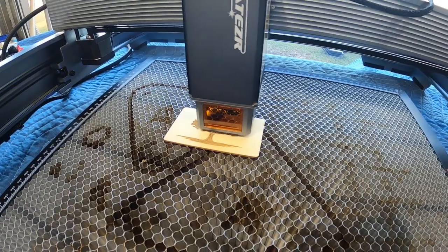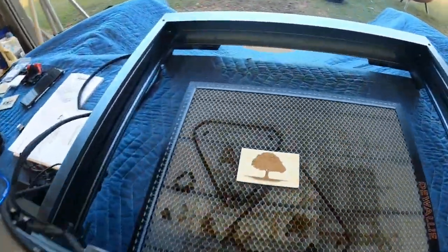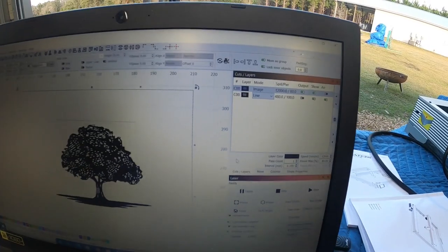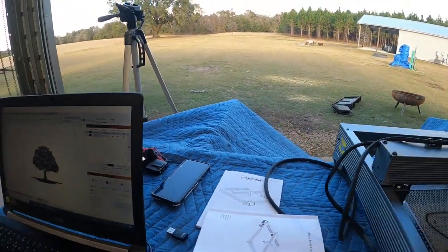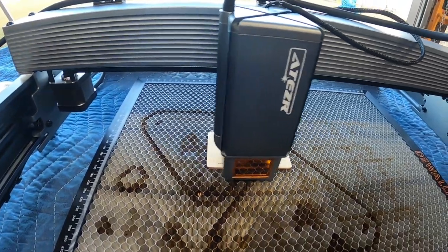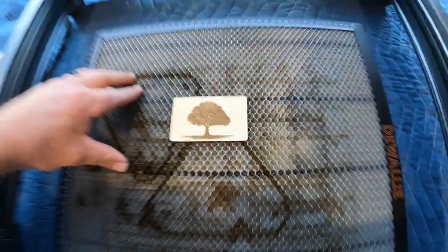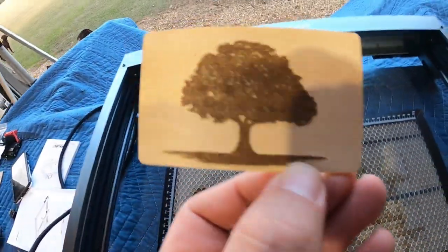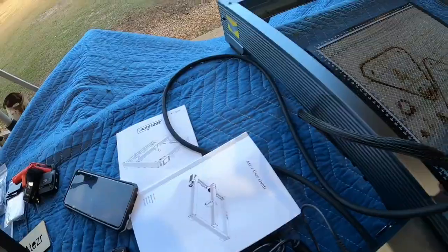You can see how fast we're going — that's quite fast for a diode laser. Finishing up this little piece; this is the logo for our channel. Just wanted to show how fast it'll move. Very good detail and engraving. Let's flip this over and double the speed — 12,000 millimeters a minute. I upped the power to 80% since I'm moving twice as fast. Just rough settings. Look at this thing going back and forth. The 6,000 millimeter a minute side versus 12,000 — and actually it looks like there's even more detail there, which may have a lot to do with adjusting the power output.